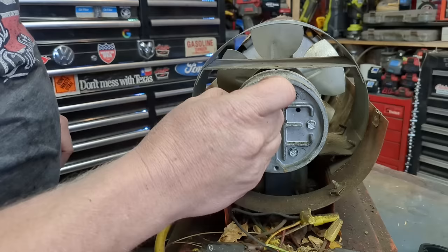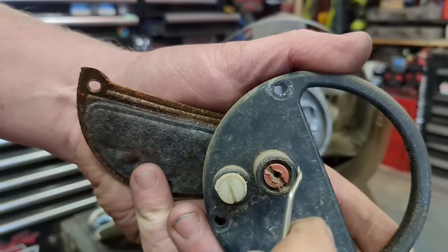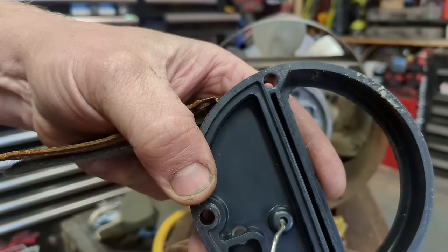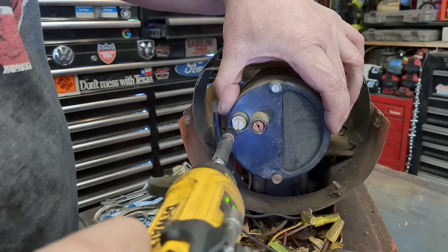I cut out a new little filter for here — this is your outlet filter, it's like a felt stapled to a cork gasket, completely reusable. I blew it off with the compressor; it wasn't even that dirty. This right here bleeds off all your excess pressure — it's simply a little plastic screw, a spring, and a ball. High pressure just pushes that ball out and bleeds off any excess. This port is simply to monitor the pressure.